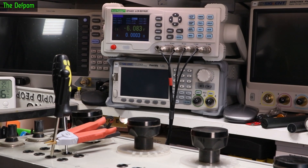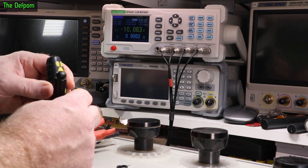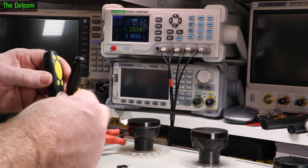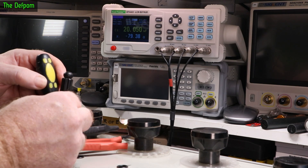So I'm just trying to measure these capacitors, but it's really awkward because I don't have the right plugs. I'm kind of just messing around trying to find a solution that will work. I do know I've measured these before, but I'm just trying to remember exactly how I managed to actually measure them - need to be just right, otherwise you can't get a connection. There we go, I've got a connection on that one there. 20 microfarad - that's working.